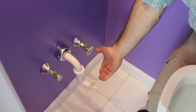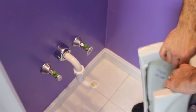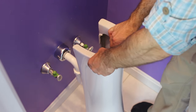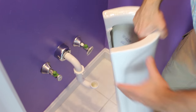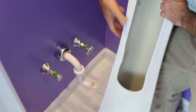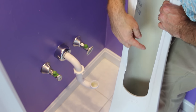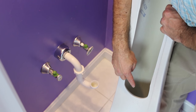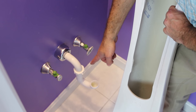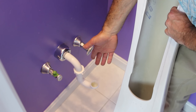The first thing you're going to do with your pedestal sink is to do a mock-up. You want to put it in the space where it's going to go and see how it fits. This is the P-trap right here, so you want the pedestal itself to fit right underneath that P-trap. There's a slot—a cutout—and you want to make sure that the pedestal you chose has a cutout that's deep enough to accommodate the P-trap height in your bathroom.